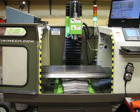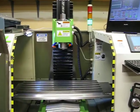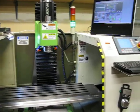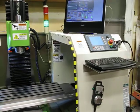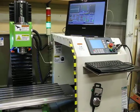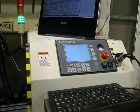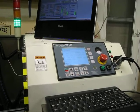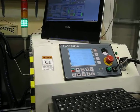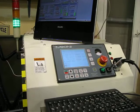I've had a lot of trouble with the electronics on it, specifically the spindle motor and spindle motor controller have died 4 times now. And the last time it died, Phil sent me all new electronics. So even though this is a very early model year 2008 machine, it has the newer version 2.0 electronics. So when I got those electronics, I had to figure out how to integrate them into the version 1 chassis. So I actually spent about a year converting the machine from version 1 electronics to version 2.